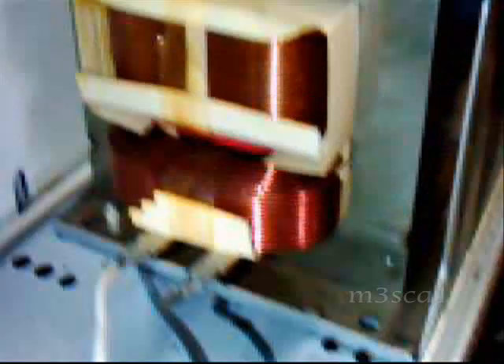We're going through this light bulb here that is a current limiter. We've got the bridge rectifier down here. From that we go to the primary of the microwave oven transformer, and one side of that we go to this electrolytic cell which we will be firing up a spark in. I'll just show you where we're at now.